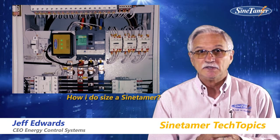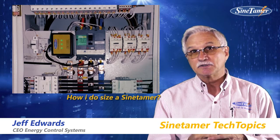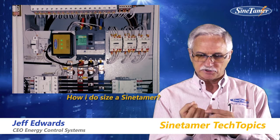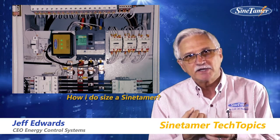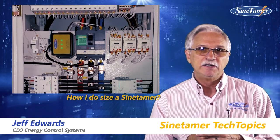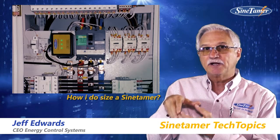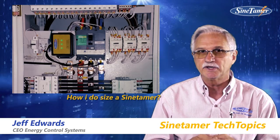It's not difficult. How do we know this is the right one? Trial and error experience over the years. Some engineers ask us how can this unit with such a small wire absorb 100,000 amps? It really cannot — it's not designed to carry all the current. Because it's installed in parallel, it's only for that 8/20 microsecond duration that it's going to absorb that kind of current. If the cable is larger, there's a potential for carrying that much more surge current, so we want to recommend a higher peak surge current rating.